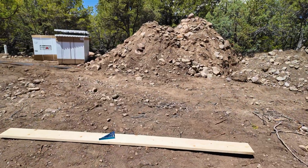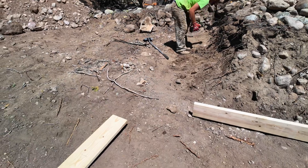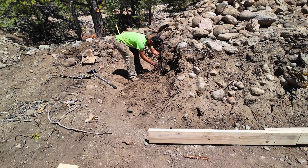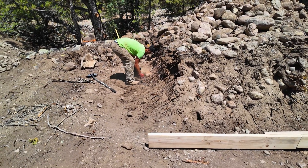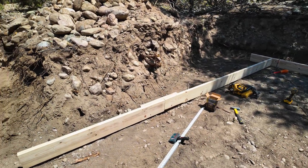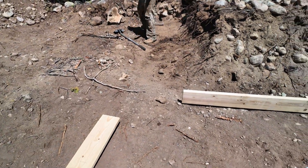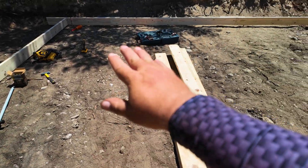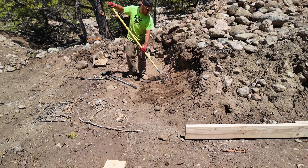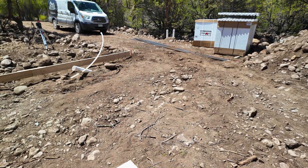Let's take a little trip over here. This wall comes along here going out 15 feet. If you line this up it's going up there, and this wall needs to come out just a little bit — it's a couple inches short. Luckily with all the rocks right here, this is the only place where it's actually sandy, so it's not too bad. That beeping is our laser — we have that out to get the top of this footer nice and level all the way around. It's been pretty easy digging because we did a good job earlier with the skid steer and excavator getting this pad site leveled out. This is really the only spot where we have to do a bunch of digging.